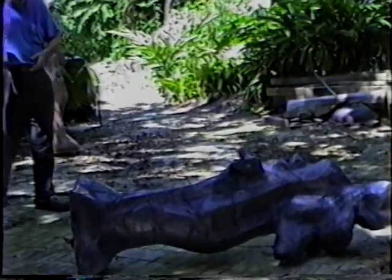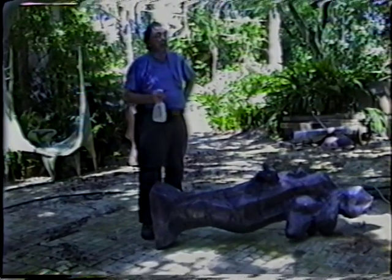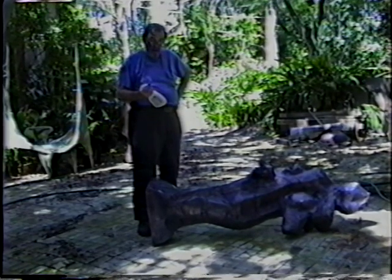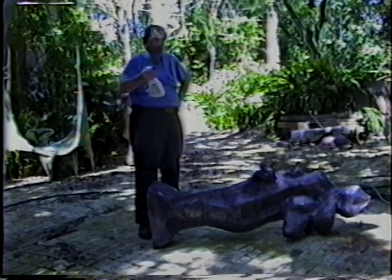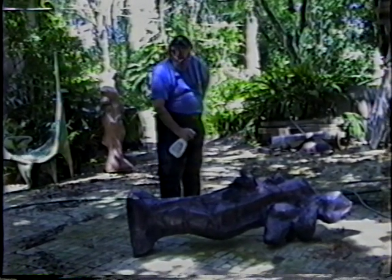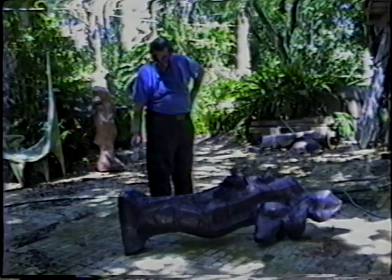This is a mix of ammonium chloride and copper sulfate. Copper sulfate can be bought at a garden supply if you ask for blue stuff. And you acquire one of these sprayers when the material's used up, so that you don't put so much on it that it will actually do a lot of running. So you're just sort of fogging it on with a fine spray.